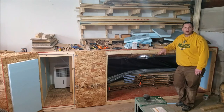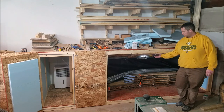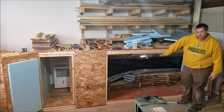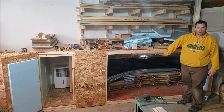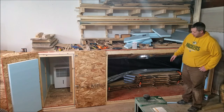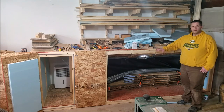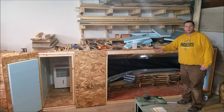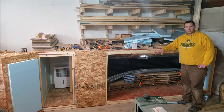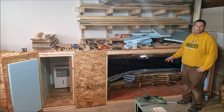It signifies an air flow issue. Today I installed this attic fan. It has a built-in thermostat. The baffle part here is angled, and then down behind here it's just straight down. The tarp is attached to that. The tarp isn't perfect — it's not going to block all air from going in other areas — but it's going to do a heck of a lot better job directing that air flow down in between the boards than I had previously.